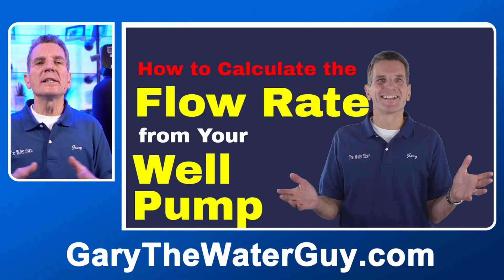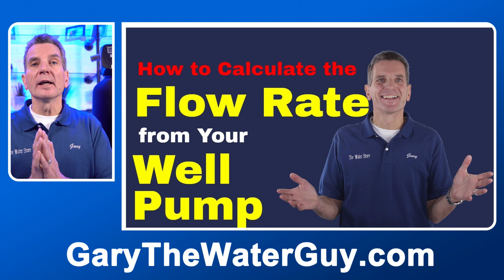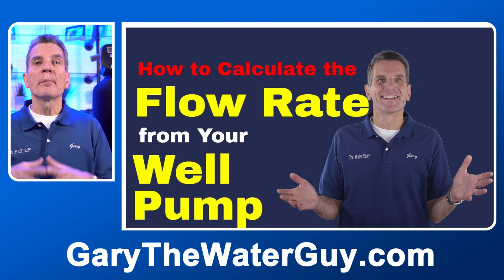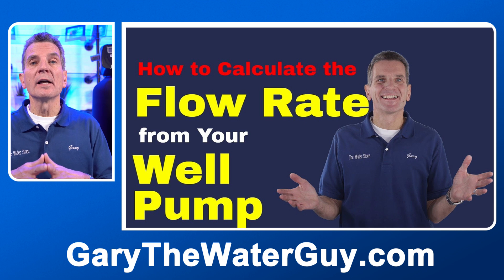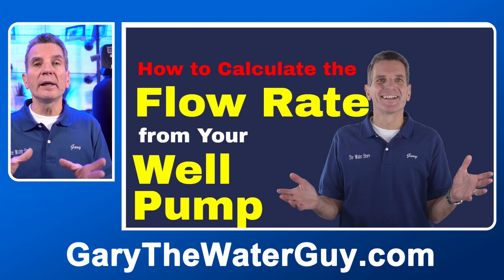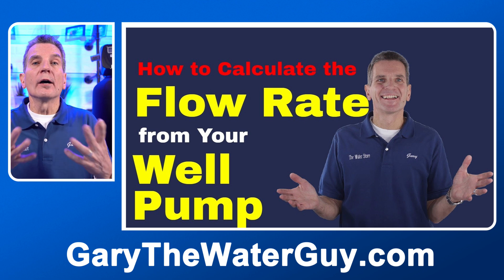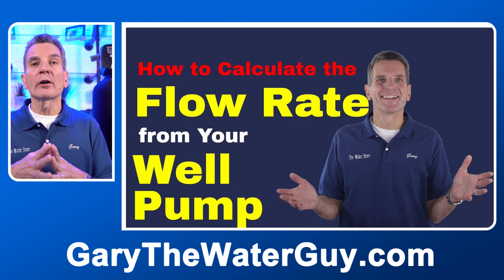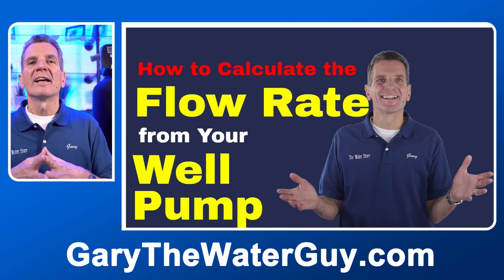If you're looking for a larger system, you really need to know the flow rate, because that's how UV systems are sized. The first system I showed you was only one gallon per minute for one faucet; the Safe Water 6 is good for six gallons per minute. But if you're looking at a larger cottage with two or three bathrooms, eight or ten people, and laundry facilities, you'll be looking at a larger system. You really need to know your flow rate from your well pump so you know the UV system is big enough to kill the bacteria as the water flows through. I've got a great video in the description below where you can test the flow rate from your well pump so you know how to size your UV system.